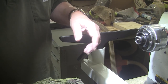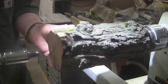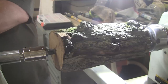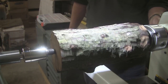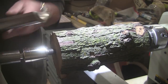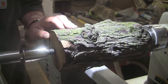Not that I'm a pro, because I'm not at this, I can tell you that. I found the center on my log and I'm just going to place that on here and bring up my tailstock. I want to drive my live center into the little hole I poked there, apply a lot of pressure, and let those little tiny teeth grab it. About 720 RPM. I'm going to use a very large two-inch roughing gouge to round this up, and that's most likely going to peel off all of the bark. But that's okay for this piece, because we're going for elegant.